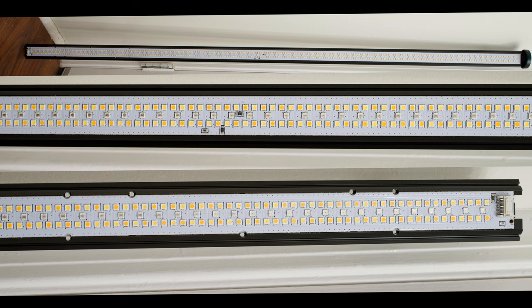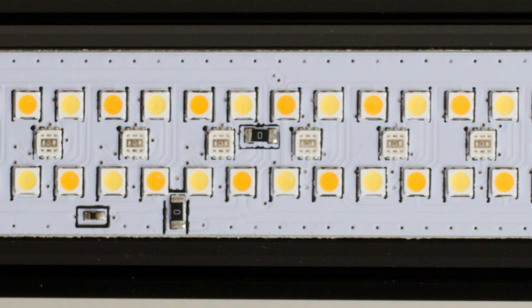The LED PCB contains 108 groups of 1 RGB LED and 4 white LEDs. Two of the LEDs are warm white and two are cool white. It is estimated that each channel of white LEDs is arranged in 12 groups of 18 series LEDs, and the RGB LEDs are arranged in 9 groups of 12 series LEDs. In total, there are 540 LED packages on the board.